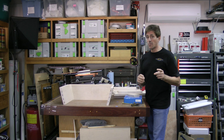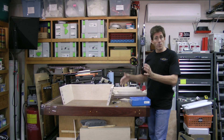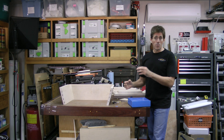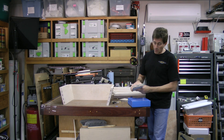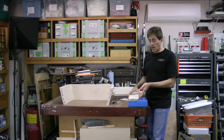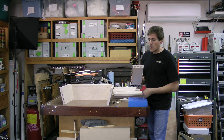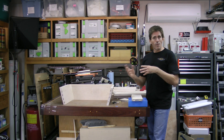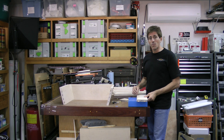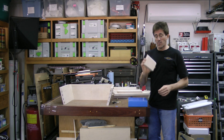I needed a better solution, so the one I'm picking is a dado stack. With the dado stack we can make the entire rabbet in one cut. What's unusual here is that when I run this board flat on the table saw deck, I'm going to have the dado stack tilted to the same angle used for cutting these parts — same angle, same calculation. That'll put a rabbet on the edge. My saw is left-tilt only, so for one side I'll have to move the fence to the other side so the blade comes up and cuts it. That's all fine and will feel perfectly safe.